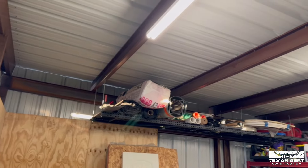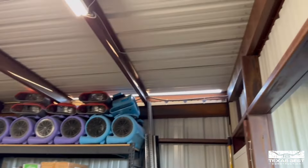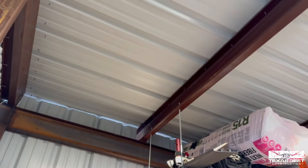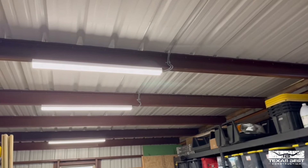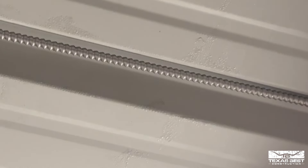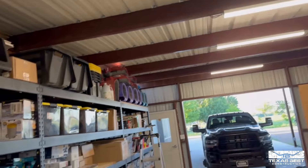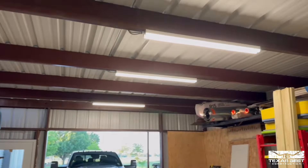Let me take you into an area where we have insulation to show you the difference. But first, this is just my tool shed — you can see the difference here. I've got concrete under this, which leads me to believe that most of the moisture under the carport area is coming from the ground, because in here we don't have much condensation. Maybe just a little bit right here — and you're catching some moisture from the outside atmosphere and interior — but no drips on the floor in this space.